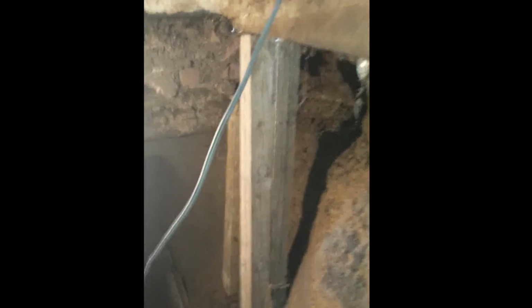So just another layer of protection, and also another medium to facilitate removal of the service line if I ever have to. So now I could even take out the PVC pipe. I could just slide it out if I just happen to have trouble taking out the copper. Also, I put up these 2 posts as well. So now we have a total of 4 posts and all the dirt that's about to get put back now.